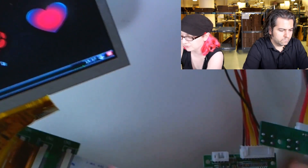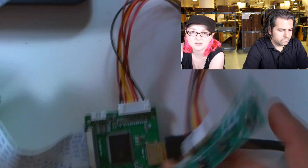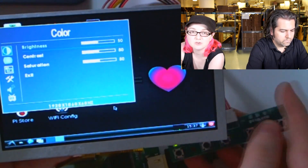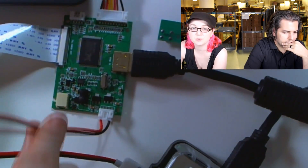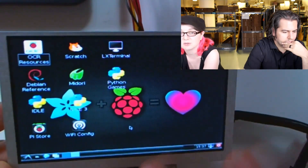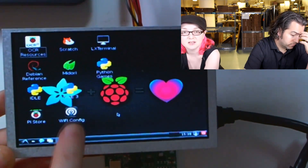There's a little mouse and it's just running X. This is driven by a little HDMI driver — it has HDMI in, then there's a cable and a cable adapter. There's also a little keyboard so you can set the color, brightness, and all that good stuff. You can also change the color, contrast, and flip the display if you want. It only has HDMI input, and it connects — for example — to this Raspberry Pi here. What's nice is it can power itself from a USB port. It just needs about 500 milliamps, and it has HDMI quality — really good-looking, crisp, and very fast. Because it's native HDMI, all the graphics-optimized stuff works with it.